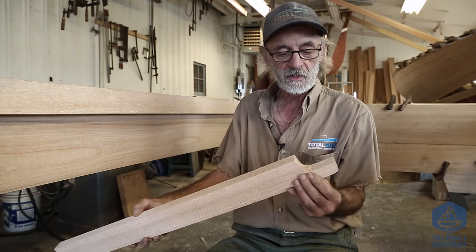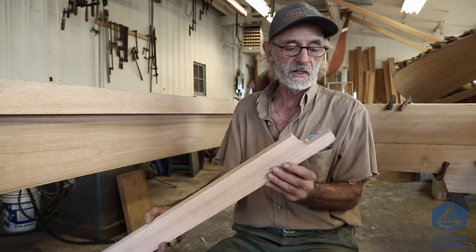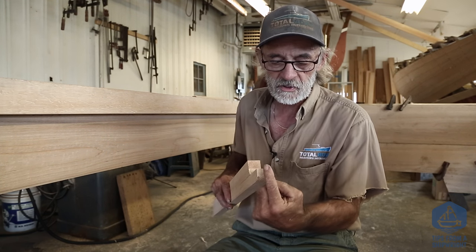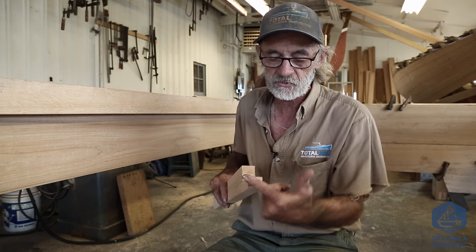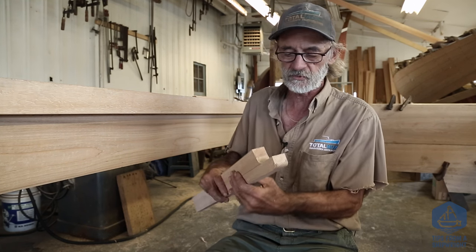This frame is exactly the same angle as the top of the chine log, so it's going to have a parallel space in between. We're going to have a couple of screws going up through here to hold it to the chine log. The other thing is we don't want the medullary rays to be exactly in line with the screws, so we try to pick some lumber that puts the medullary rays on a little bit of an angle. Most of it's going to end up kind of diagonal, and that's fine.